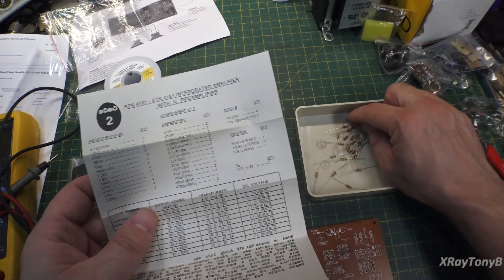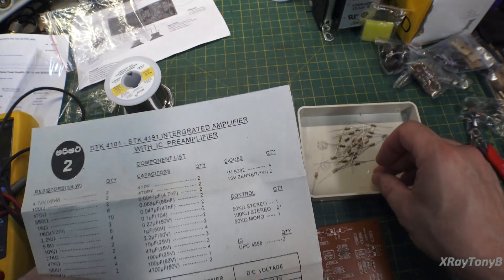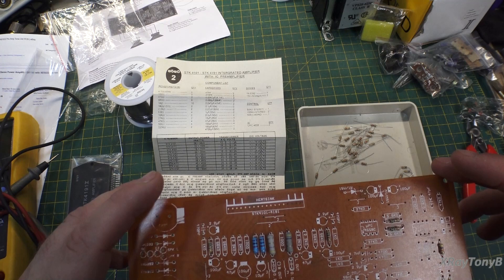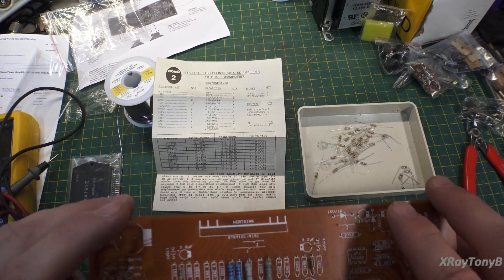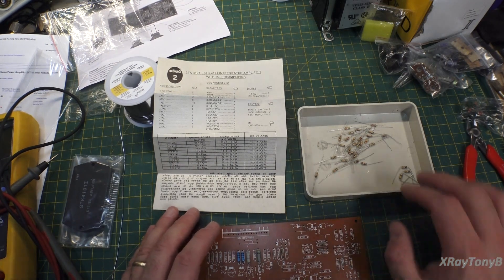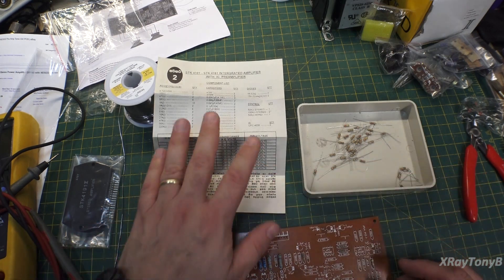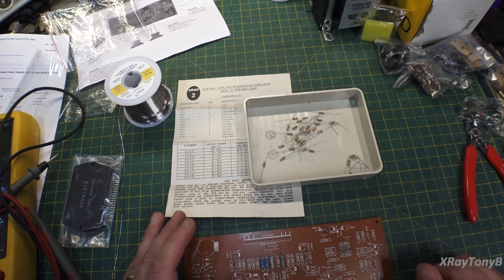I also have some 2.2k resistors — those are listed and there are six of them. So anything that deals with 5.6, 56k, 5.6k, 560 ohm, and 5.6 ohm values — that's where we have problems. Now the question is: was the board silkscreened incorrectly, or did they not put the correct components in the bag? To make matters worse, there is no schematic for this. I will have to go back to the eBay listing and see if those components are listed or if there's a schematic.